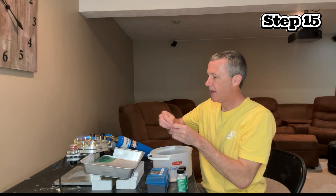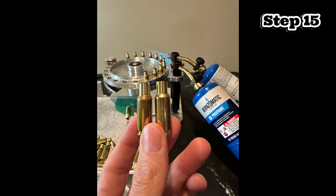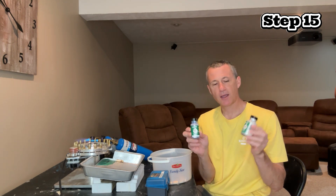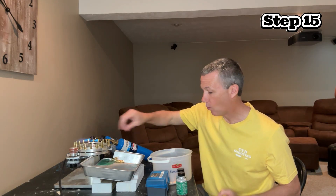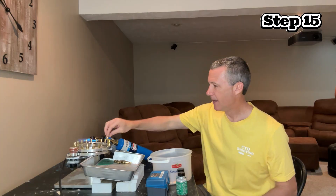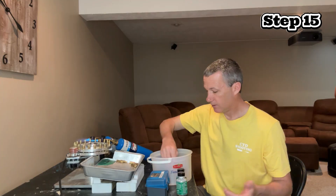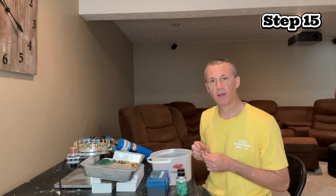I set this annealer up to produce a deep, dark gold color that's still shiny when the cases come out. I used to use two different temperatures of Tempilaq — a 450°F and an 850°F. The annealing happens at 450°F, but I don't want it to reach 850°F. So I'd paint one side of the neck with the 450°F and the other side with the 850°F. I wanted the 450°F to melt but not the 850°F. Through experience and reading directions, I learned that the deep gold but still shiny color was what I was looking for.